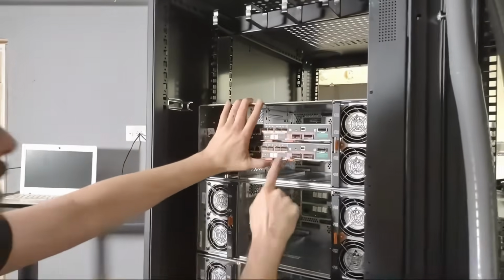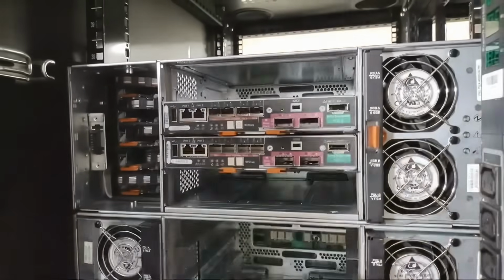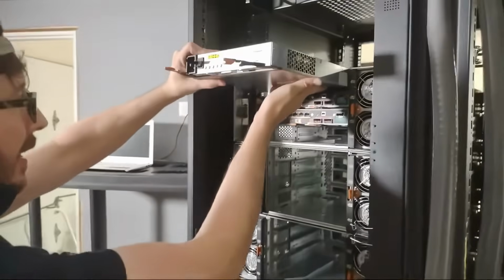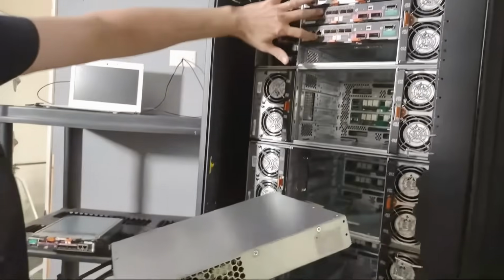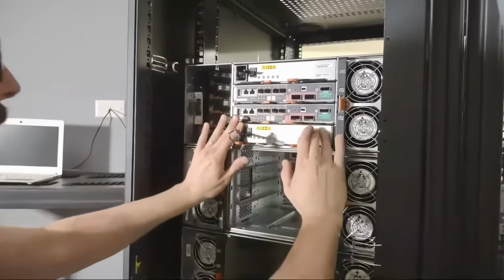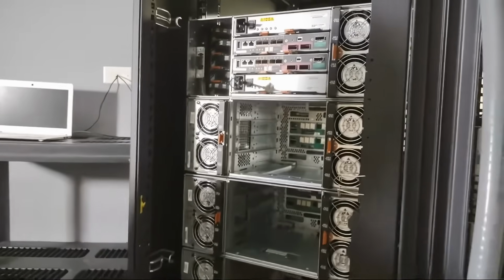And so these have the InfiniBand, which is what we're going to be using. I already tried the fiber channel, could not get fiber channel to work on these at all. And you can daisy chain off your SAS expansion off the back of this. And then they've got the power supplies that fit up on the top. Another option is you can get the SAS controller cards here and turn this into just a normal SAS 8088 driven machine. And that's essentially very much like a Dell MD3060E.